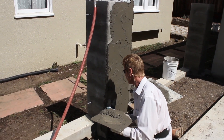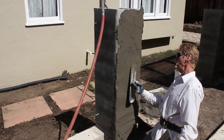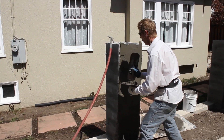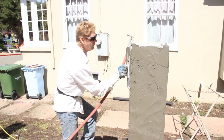Remember what we're after — we're after an adobe look. We want it kind of ugly, humpy and bumpy, jagged and sandy. So I'm going to allow this to set while we do the other 12 columns. In order to match that existing finish, we've got to let this sit. What happens if I hit this too soon with water? It won't match — it'll be too gritty and won't have that painted look.